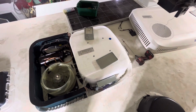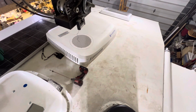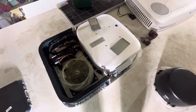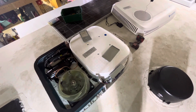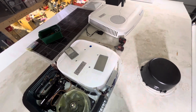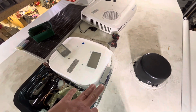The project here is wiring a Micro-Air EasyStart soft starter into a Houghton or RecPro RV air conditioner. This is the first time I've wired a Houghton — I've wired EasyStarts into other air conditioners, it's not complicated. The only difference is that the Houghton has two junction boxes, one on each side of the air conditioner.